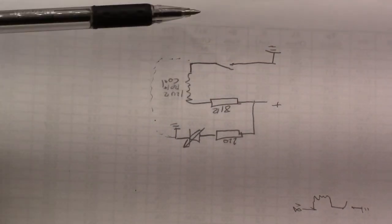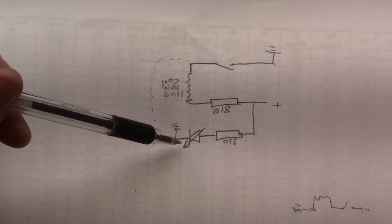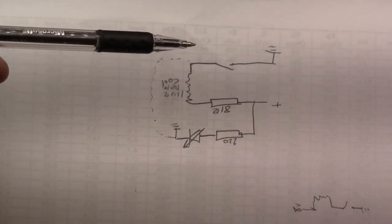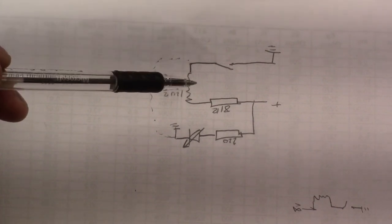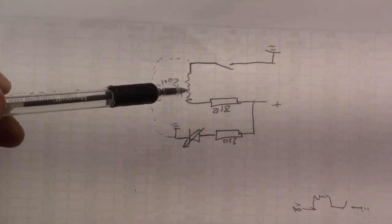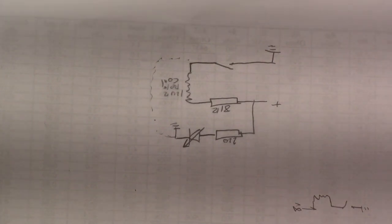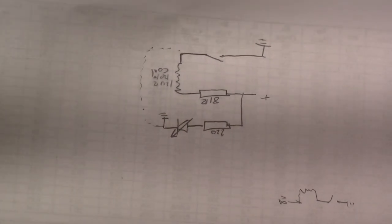After looking at that, what I decided to do was disconnect the LED from the ground and just connect it to the switch. Because when it's on, they're both tied to ground anyway, so there's no difference in the end schematic. Operationally, it's exactly the same as before. And even these two being connected doesn't cause a problem because it's only one half of a circuit, and they share the same source anyway, so it doesn't make any difference to how it operates.